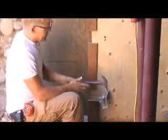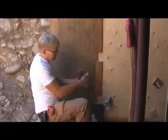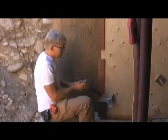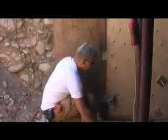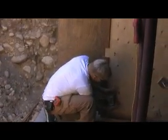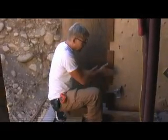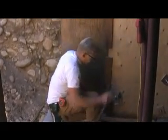If you do a wall like this, with a sheet of plywood like this, what you're going to get with this system is buckling between each one. You need a different type of reinforcement, because this is only giving this reinforcement to the plywood area. It's going to push like crazy. You can do it. I don't recommend it, because your wall is going to have a bit of a wave in it as it goes down. So here's what else you do.